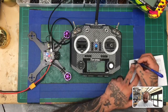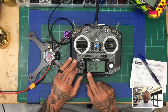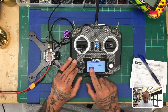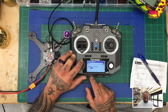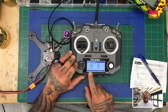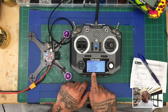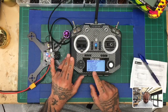Write down the model number you're using — in this case number 34. Hold down your enter button (the silver button), it will say 'create model,' press it again, and it loads the models. Scroll to 'multi' for quad. Go through the defaults: throttle is channel 1, roll channel 2, pitch channel 3, yaw channel 4. Press page through all those, and at the end screen it says 'enter long' — hold the enter button for more than a second to confirm.